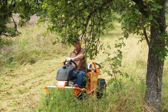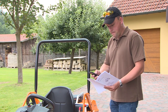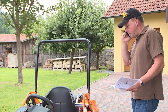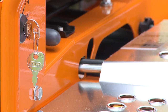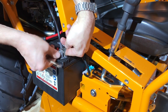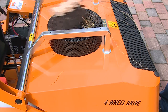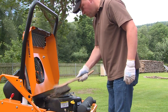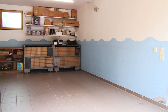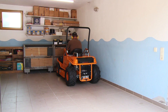To ensure that the mower functions safely and adequately, resort to the service recommendations in the operator's manual. The blade system in particular requires regular inspection. Except for those qualified, never run the risk of doing service work yourself. Trained technicians are available from your dealer to complete any necessary work on your equipment. Before doing any service work, remove the key to avoid accidentally starting the engine. While performing any service work close to the engine, it is imperative to disconnect the battery. Only begin to work on or clean your machine once all moving parts have come to a full stop. Never interfere with safety devices. All covers and shields disassembled for service work must be replaced. Allow the engine to cool down after working before parking it in an enclosed space. To avoid the chance of fire, clear away all stuck-on grass, leaves, or other remains from the engine and muffler areas.